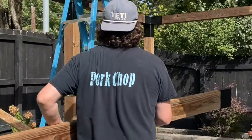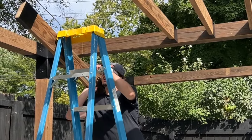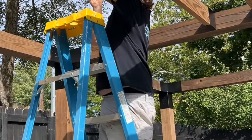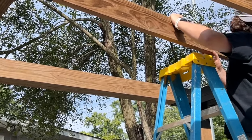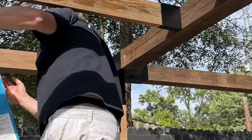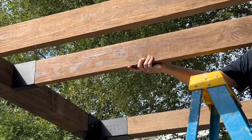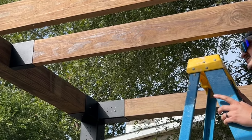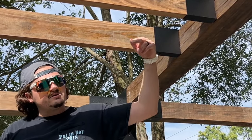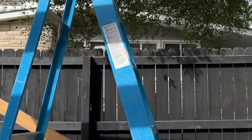We take these up here — I already have my rafters marked where I need them to go, and they just fit right up on there. After I do that, I'll anchor this side first. If I need to tap any of the metal to go jam up against that wood a little bit more snug, I'll just tie everything in. It's as simple as that, and it makes putting a roof on this much easier.